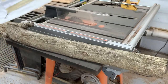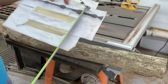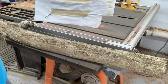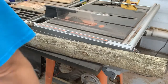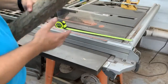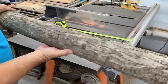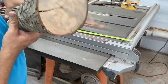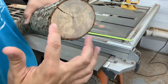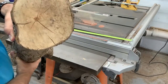So we need a nice straight knot-free 14-inch piece of wood. It only needs to be about three quarters of an inch in diameter once turned, but it needs to start out quite a bit bigger than that. There's a knot down here but I bet we have some pretty nice wood in there. If you look at the end here there is a crack — it goes down to the pith — but the rest of this is solid.